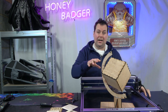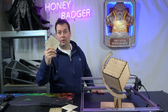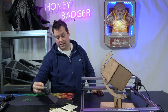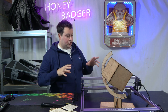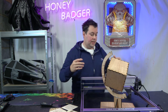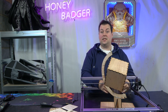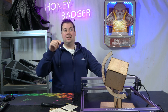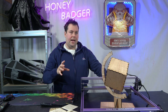It all went on this base, which was cut out of 3.5mm ply. We've done some engraving on some coasters and we also managed to engrave a spatula, which we'll show up close in a second. One thing I would say is I do feel like this needs the air assist. Air assist is tubes that go down the side of the laser and basically blow directly onto the material, cooling it enough to cut deeper without burning the wood.